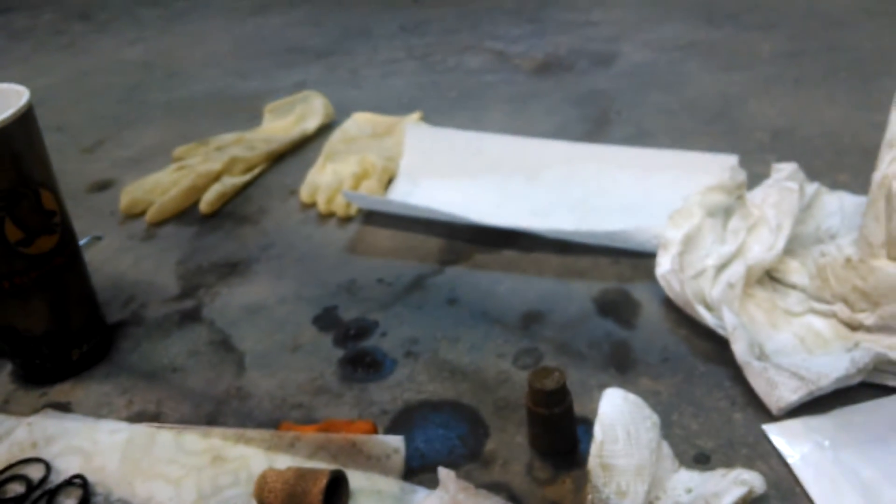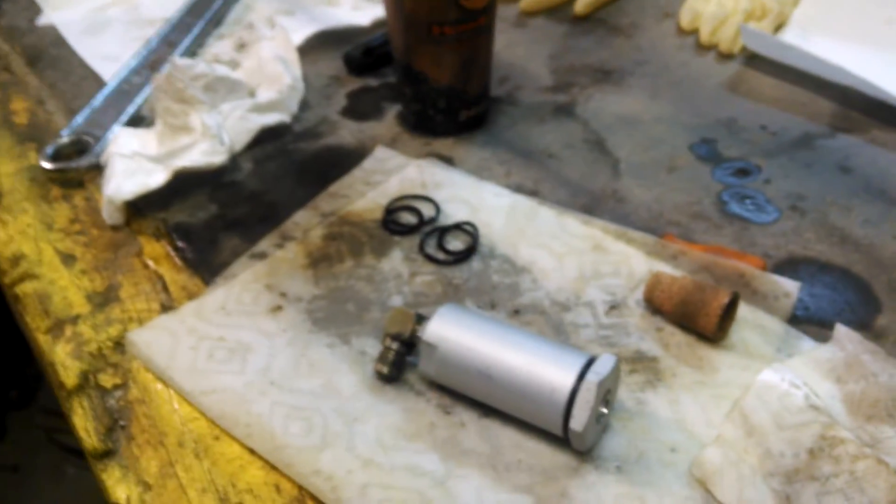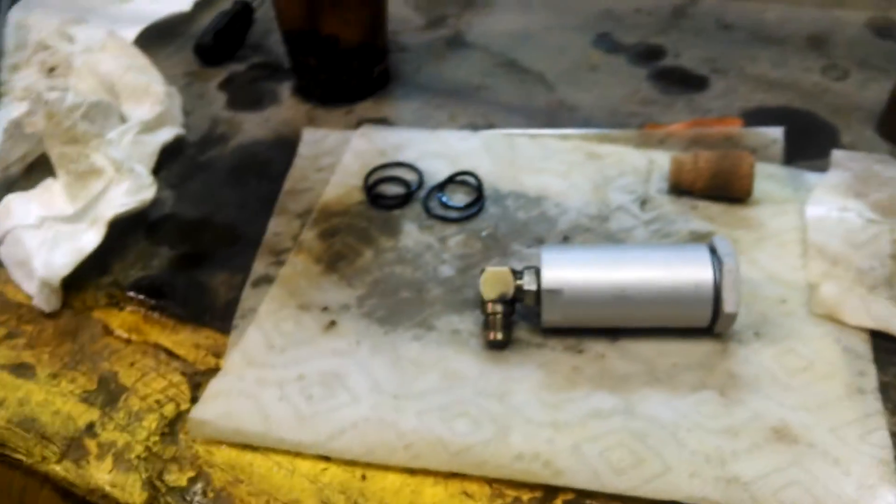If you're doing it for reasons of final drive failure like I am, you're going to want to make sure that you pull the lines and flush them. Keep everything as clean as you can. Use a wire brush before you pull them off, clean everything up real nice and then just reassemble. That's very basic and very quick, but basically just wanted to show you where they're located. Thanks.